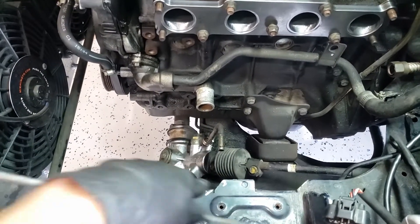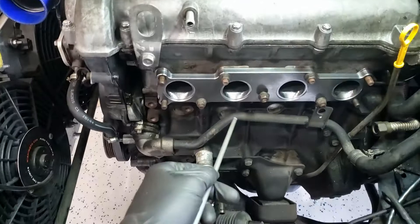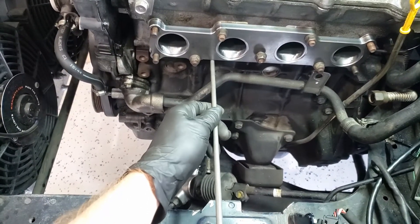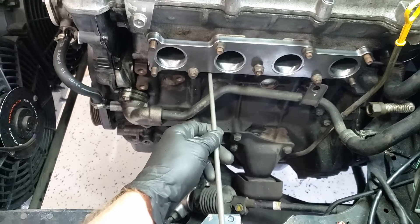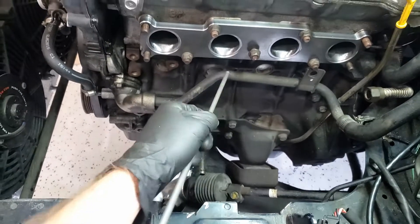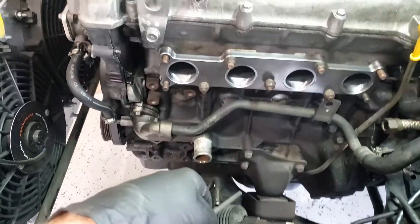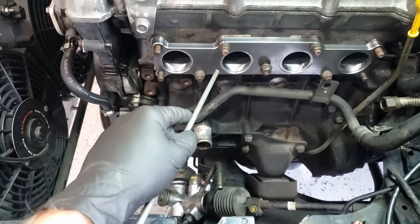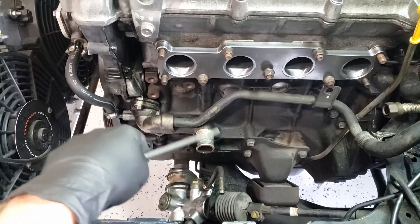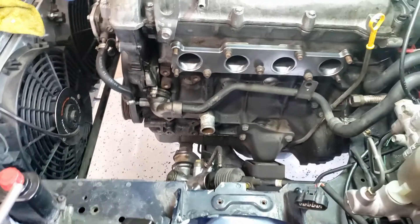So I notched the body here and here. I got some metal rod and I'm gonna weld it between the exhaust manifold and then the T25 flange — that'll hopefully lock the location between the two, and then I can start working on the piping and get it all kind of figured out and routed the way I need to.